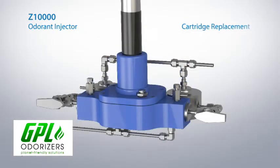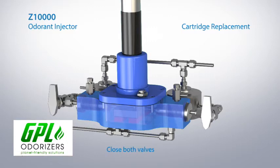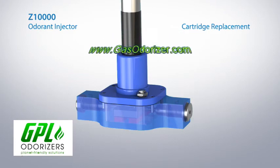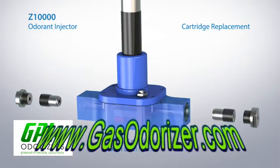There are no seals or diaphragms to replace in the odorant section of the pumping circuit. The only replacement items are the hydraulic piston seals, which have been engineered for high cycle life. When piston seal replacement is required, the drive system is easily isolated from the pump modules by closing the isolation ball valve located on each hydraulic line. The piston seals are captured within cartridge assemblies to allow for quick and easy replacement.